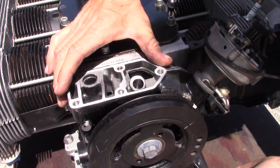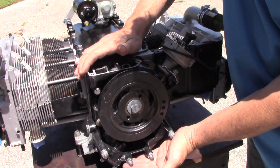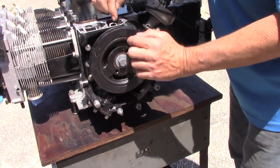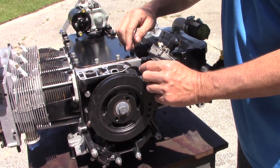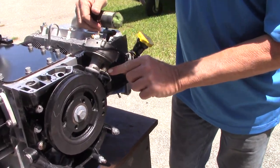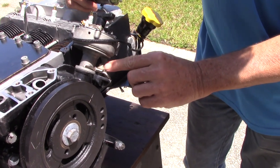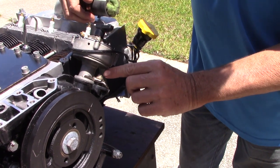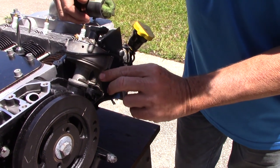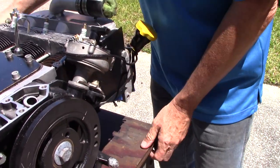If you buy an HV2000 rear oil accessory case from us, it comes with that part already done. Bob did this piece himself a decade ago and missed that detail, so that's going to get corrected while he's here. Continuing to move around: this has an original style distributor clamp on it with an MS nut, and that is correct. We want people to catch that — always use a locking nut, and that MS nut is an excellent choice.